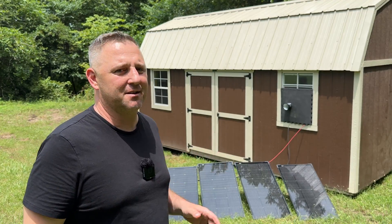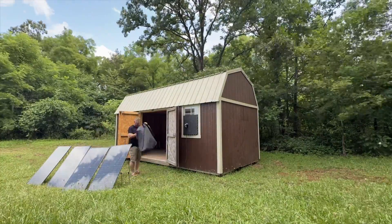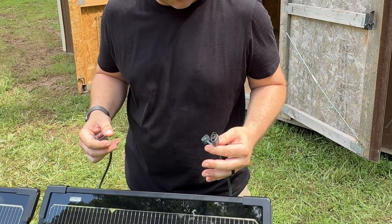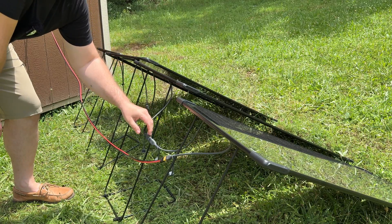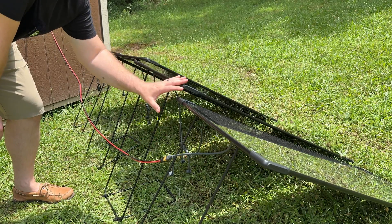To keep this whole system going for the day, I've got 500 watts of solar power — that EcoFlow modular solar panel set. I did a review on this a few months back, but the best part about this system is it's all plug and play. You essentially daisy chain all of the solar panels, wiring them in parallel so that the voltage remains the same throughout the system. That's a very good feature of these modular solar panels.